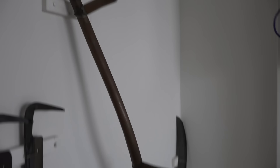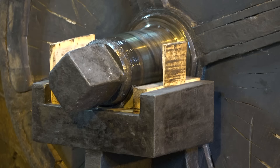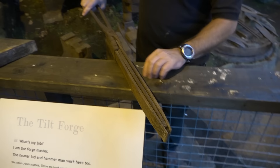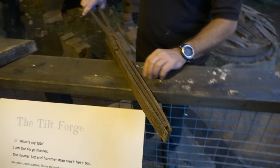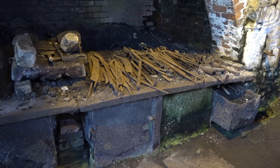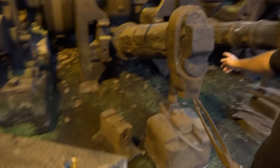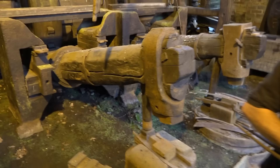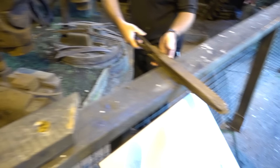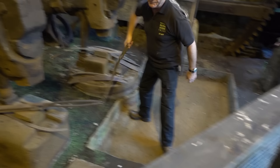You can just go all the way down — these are the products. Scythes. A proper one with side handles at different angles and an S-curved shaft. Hay knife, grass hook, beat knife. None of that multi-purpose rubbish. Three pieces of steel to start off a scythe. The middle piece is what they used to use — shear steel, which was like a slightly higher carbon content. When they put it in there, heated it up to a temperature about a thousand degrees, it would be hammered and start welding together.